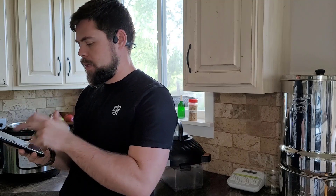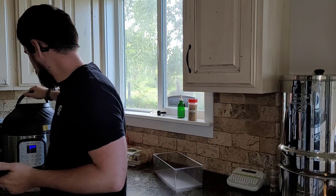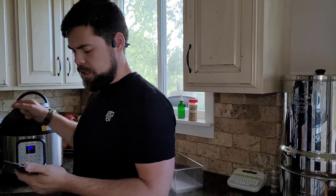I'm going around checking stuff on the app and tracking all the power usage. The top one is still using tons of power. I'm going to go ahead and use the air fryer here and see what we can do — I think these outlets are on the left side of the electrical panel. Yep, 1,700 watts right there for the air fryer. It's running it, so I'll let this run for about 10 minutes and see how much power it uses. After all of that, it only used 1.4%. Not bad at all.